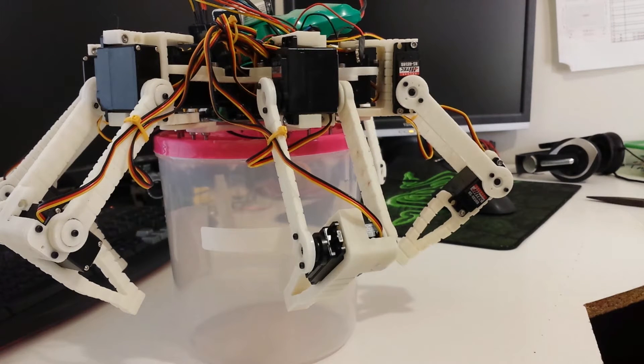So what software am I using? Currently for testing purposes I'm using the Phoenix Code written by Kurt Eckhard and Duuren Janssen at LynxMotion — sorry if I'm mispronouncing those names. However, I do have my own kinematics and walking gaits that I'm implementing on a Raspberry Pi, which is going to be the next stage of the project. Just for testing to make sure all the hardware is working correctly, I'm using Phoenix Code since it's known to work — and boy does it work well. I made a few modifications to the kinematics and SSC32 communication drivers to match my setup, then adjusted the hex_cfg configuration files to specify my leg lengths and body dimensions, and now it's working really quite nicely. Big shout out to Duuren and Kurt for writing Phoenix Code and making it available.